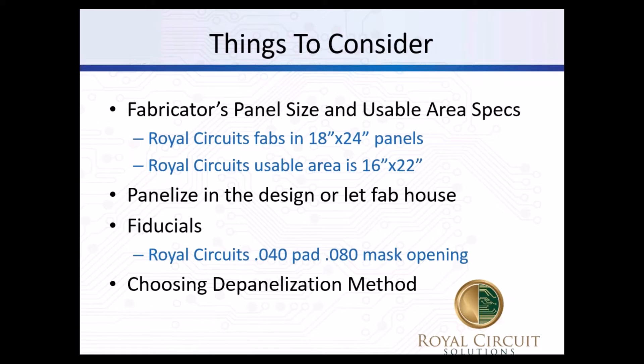For making a board, there's no inherent advantage to whether we panelize or not - whether it's going to be an array. We'll maximize the quantity we put on the board. After talking to the assembly house and your fabricator, once you know the requirements, you can decide if you're going to set the boards into an array in the design or provide a mechanical drawing to the fab house on how it needs to be panelized. We regularly send back panelized Gerber files for array approval before we begin fabrication.